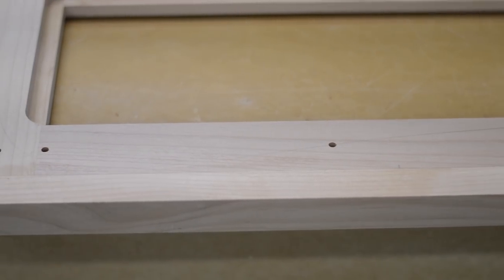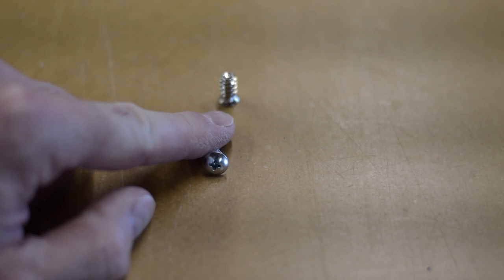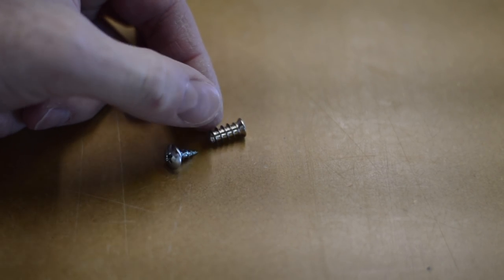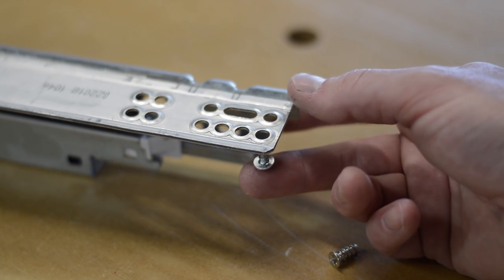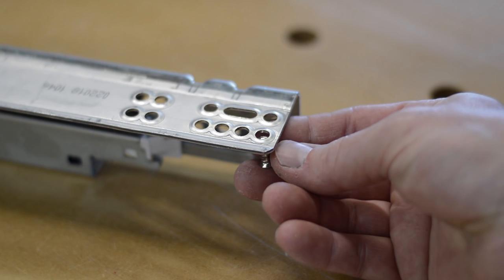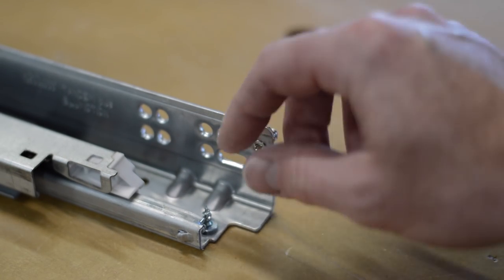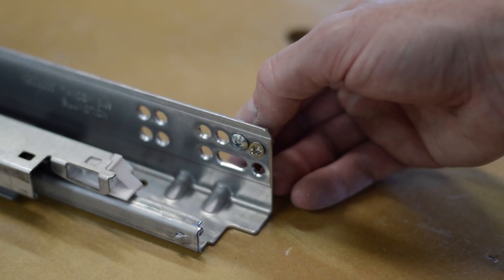Here's the payoff: accurately placed 5mm hardware holes. Let's look at why it's worth the effort to use 5mm system screws. Here I'm showing a traditional pan head screw versus the 5mm system screw. The pan head screw has a lot of play in the holes punched in the drawer slide, whereas the 5mm system screw mates with the drawer slide much better. This is beneficial for two reasons: one, everything will go in with less fussing during assembly, and two, it prevents any shifting from usage over the years.